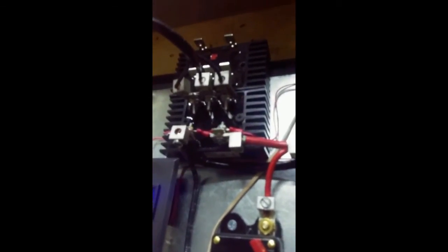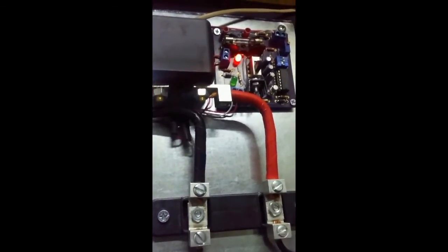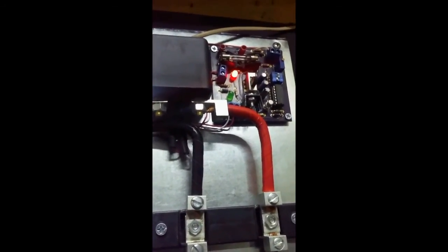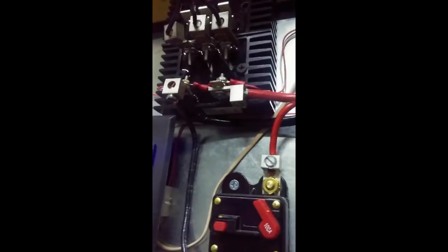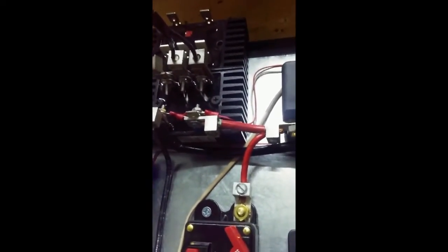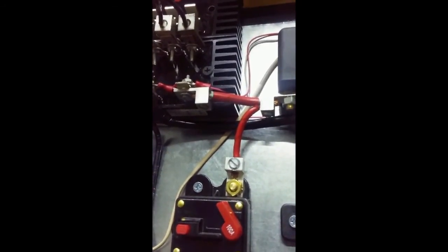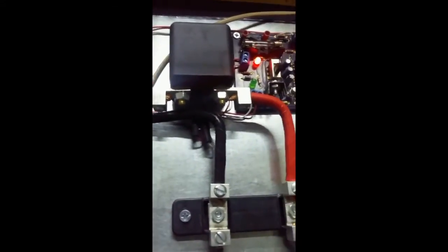So if your voltage is at 14.3 or 31.2, you dump at that voltage and it won't charge the batteries anymore. With the delay settings you can match up your perfect match — maybe you want to set it a few volts earlier to dump because it's delaying. You have to tweak it a little bit. It doesn't take any power from your bank. A lot of times at nighttime the battery bank will be drained down — instead of 12.6 it might be 12.4 — and then the wind dies. Now you're stuck with 12.4 when it should really be 12.6 because that other system drained the batteries. This system doesn't do that.